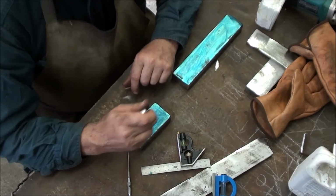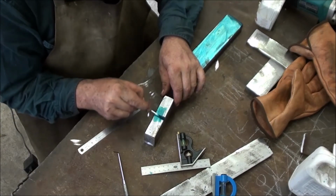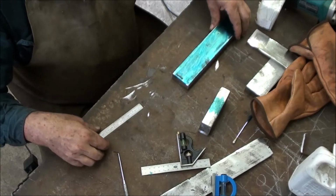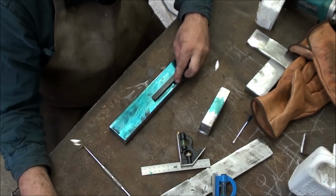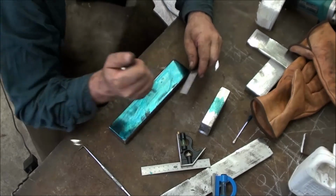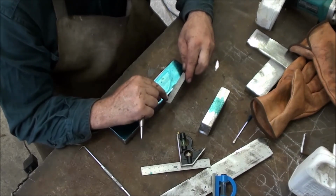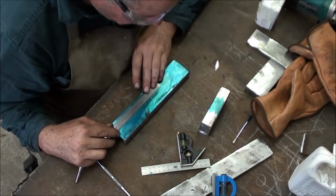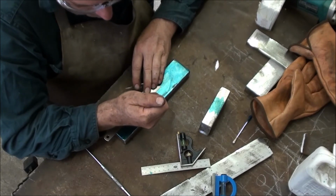So these spots don't have to be exactly on the money for the simple reason that they're just the let's-try-not-to-stuff-it-up numbers. So you want to go out 35. I really should have my other glasses on. Right, this side here is in 0.5 mil and then it goes up to 1 mil. And what I really want is I just want to clear 1 mil, because when you're not working in 0.5 mil increments, it becomes distracting.